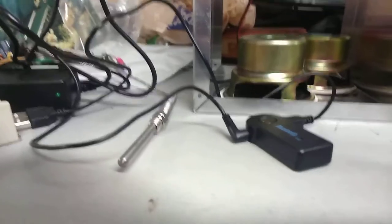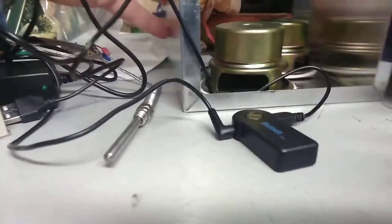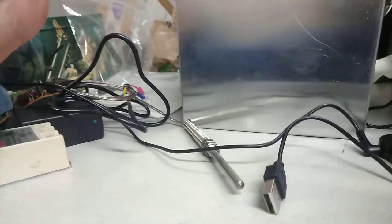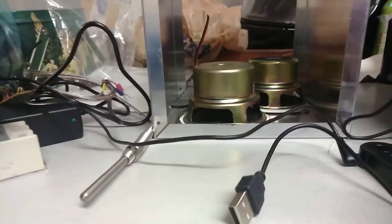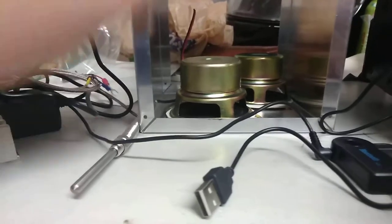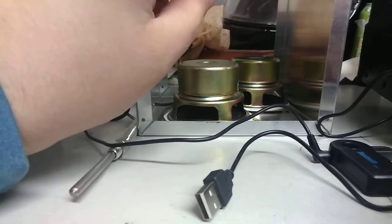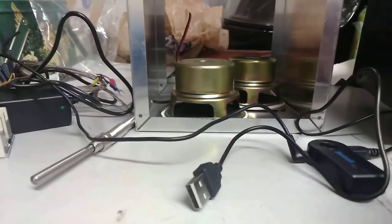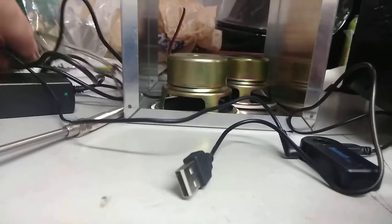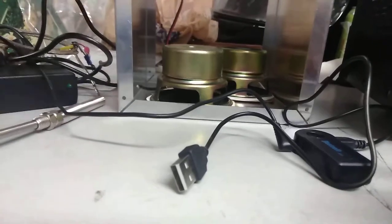I'm going to use a two-port USB-A wall power adapter, and I'm also planning on installing another USB outlet somewhere so you can charge your phone while the kiln is plugged in. As far as wiring goes, I'm probably going to have two switches — one switch for the kiln controller and element, and the other switch for the accessories: the Bluetooth speaker and the phone charger.